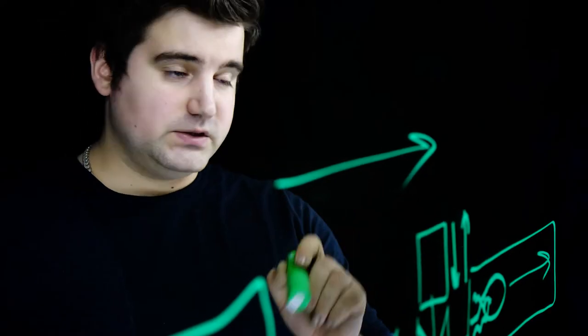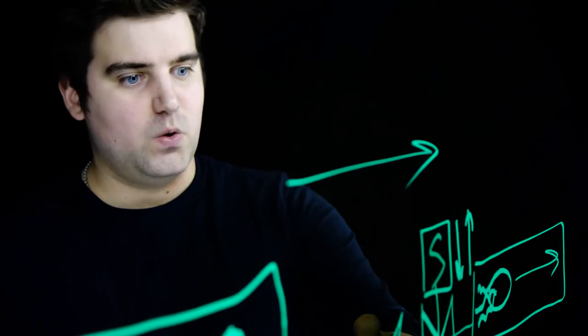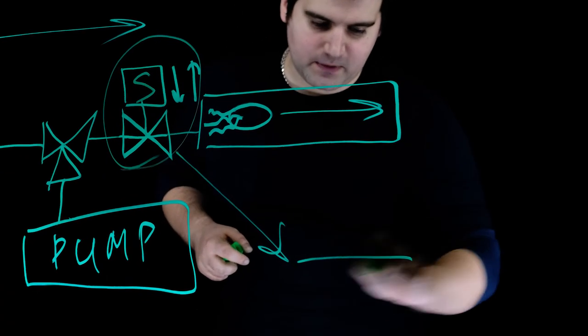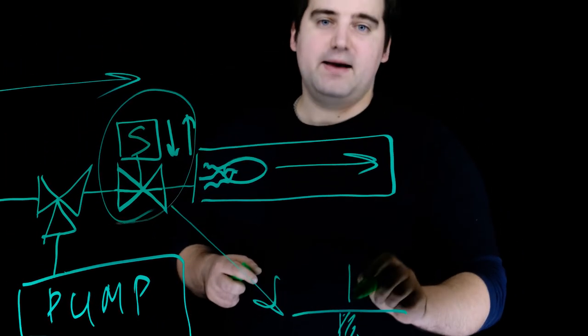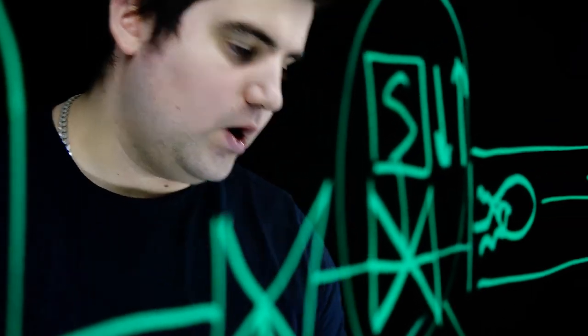This principle works not only for the nozzle but also for the solenoid, which will be used as a valve with a quick open/close ability. So what is a solenoid? A solenoid is a common valve whose flap moves by a magnetic field, and it should have as big a hole as possible — otherwise it will waste most of the blowing power.